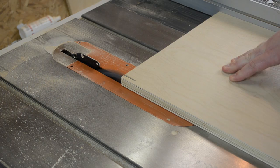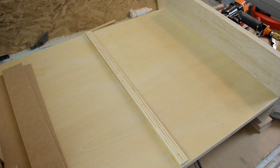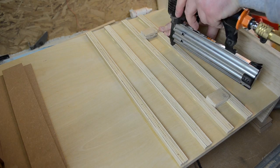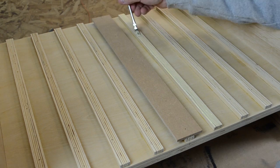I remove the spacer and slide the fence over, which makes sure that all the spacers are cut to a uniform thickness. Once I had all those pieces cut, I laid out my pieces upside down and clamped them to my workpiece. I made two small spacer blocks to ensure everything would be evenly spaced. I started in the middle so that if I had any error, it wouldn't compound itself toward each end. The first piece is critical to get in the right spot, as every piece from here on out references off that first piece. You can clean up any glue squeeze-out with a damp rag. I then installed my hardboard for the T-section of my slats, using glue and brad nails to secure them in place while using my spacers to keep everything aligned.